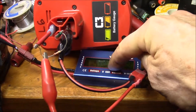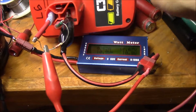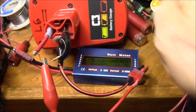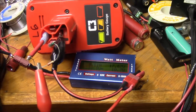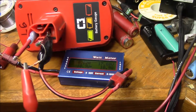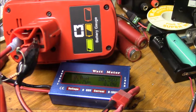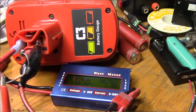We've got 172 milliamp hours — I think that'll be the first time I've measured capacity on this extended capacity pack. This was one of the dead packs I purchased off eBay, and it wasn't actually dead. We'll see what kind of number we get when it finishes. It looks like we're nearing the end of charge — we're down to 60-70 milliamps and we've got 2.064 amp hours.